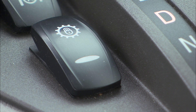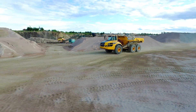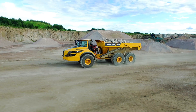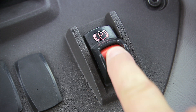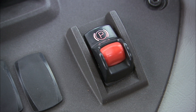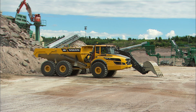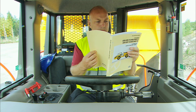The gear shift inhibitor is used to hold the gear in certain situations. The machine features several safety functions that protect the engine and transmission. For example, the engine can only be started with the gear selector in the neutral position, and no gear will be engaged until the parking brake is released. Read the operator's manual for more details.